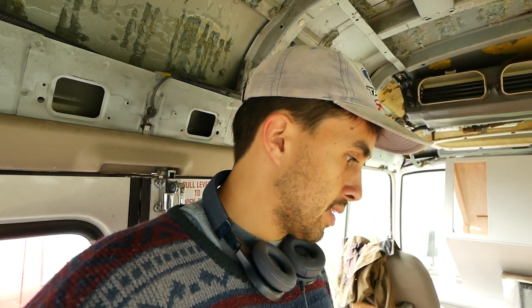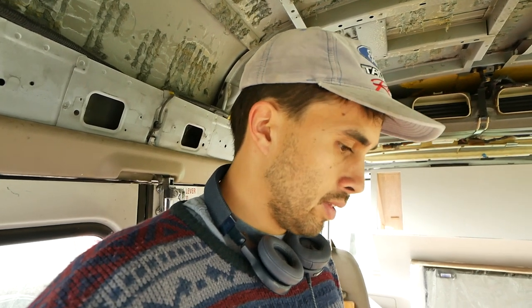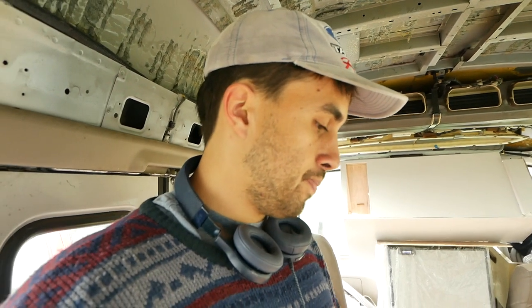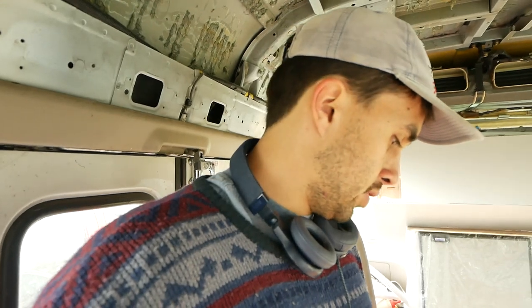Hopefully that mitigates some of the blotches I can see now. The reason it's a little blotchy is the cork and the cracks were just soaking up the polyurethane. So I decided to put it down quite thick and I think it's actually working a treat. I'm willing to accept the blotches in order to have that nice thick film over top. Obviously I'm not a professional.